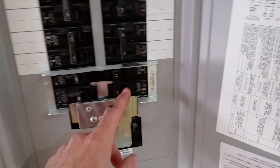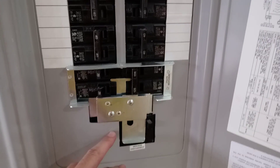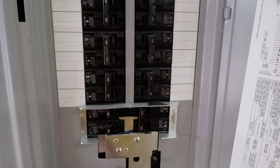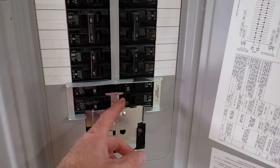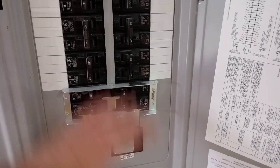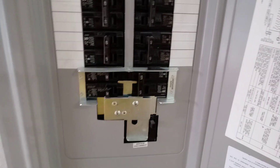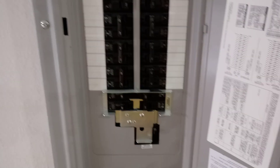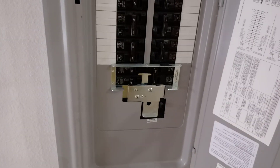We're going to feed this with 125 amps from the inverter side. I left this panel on the grid because I think he's going to have a problem eventually with all these instant hot water heaters trying to run through these inverters. So if he does wind up tripping this a bunch, he can keep this on the grid, and then if the grid fails and he needs to run a water heater, he can be careful — he's got around six instant hot water heaters and they draw a pretty decent amount of power.